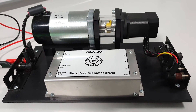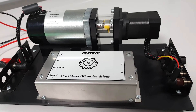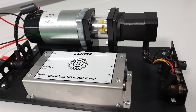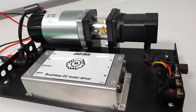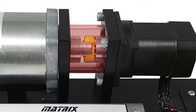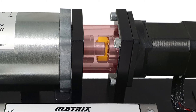Our latest Level 2 and 3 courses require the impressive HP 2001 DC motor and brushless motor pair to aid in study. The HP 2001 consists of a 24-volt DC motor coupled to a 24-volt brushless three-phase motor with an integral brushless motor driver module. All moving parts are safely contained under a clear plastic shield so that no rotating parts are exposed.